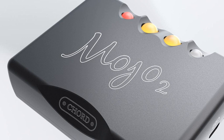The problem we have with digital is that we have one sample, and then 22 microseconds later, we have another sample. The problem is the brain needs to know what's going on between one point and the next point. And all conventional filters have problems in working out what was going on between one sample and the next sample. And this means that transients are either slightly too early or slightly too late, and they're constantly being modulated by instruments in the past and in the future. And this modulation blurs the transients. Perceptually, what that changes is the ability to perceive pitch, particularly bass.